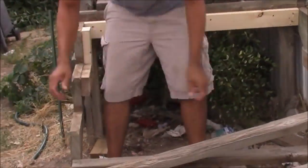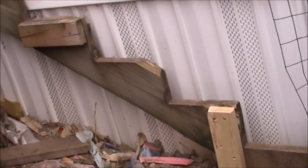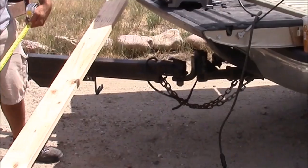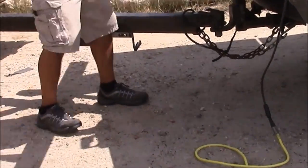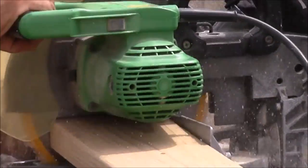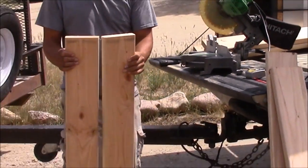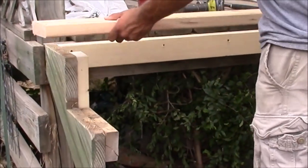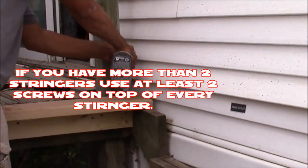Now I've got all my boards removed, so it's time to go ahead and put on my new stairs. I'm going to be using two 2x6s for each step. I'm going to make my necessary measurement — it's going to be about four foot — so I'm going to use an eight foot board and cut it exactly in half. I have five steps, so I'm going to go ahead and cut ten of these the exact same length. We're going to start with installing the top board on the stairs first, securing it on both ends using two screws on each end, plus securing it to that middle 2x4 that we installed earlier.